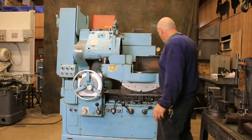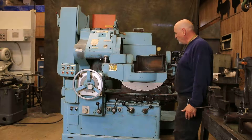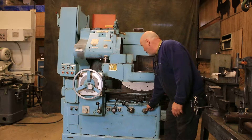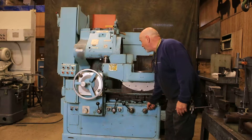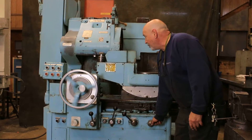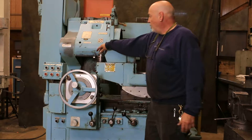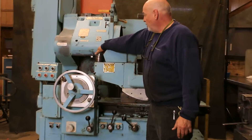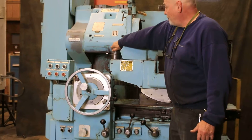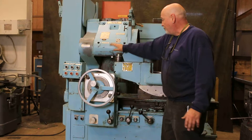We have it running at the moment. Here's your chuck controller — we're magnetizing and demagnetizing the chuck and your workpiece. You have a wheel that moves up and down to come to your workpiece. Over here you have a diamond for truing the wheel, and this has about a half a revolution of travel.